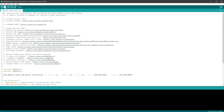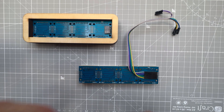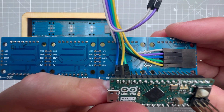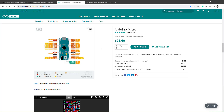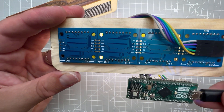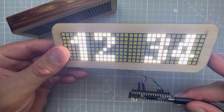Make sure the board is set to Arduino Micro and the correct port, then upload. To connect the display to the board: in the Wokwi sketch I was using pins 10, 11, and 12 — the Arduino Micro also has those pins in the corner. Clock goes to pin 11, data to pin 12, chip select (CS) to pin 10. Also connect 5V and ground. Once everything is connected we should see the blinking time.